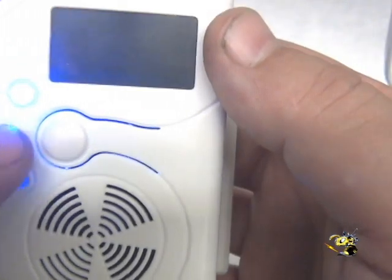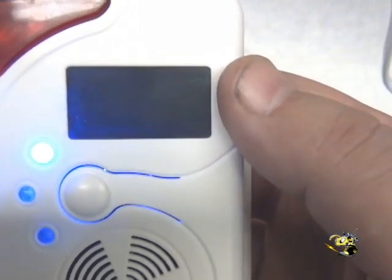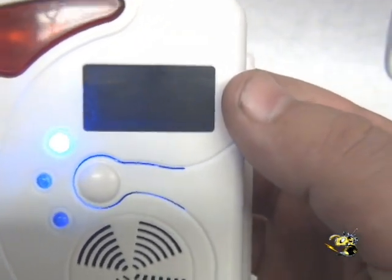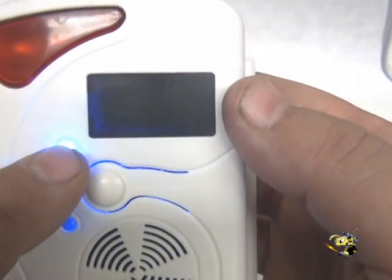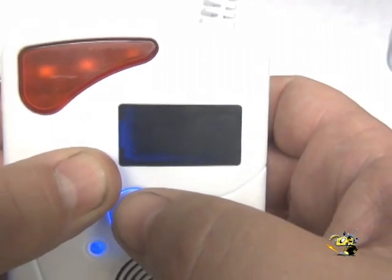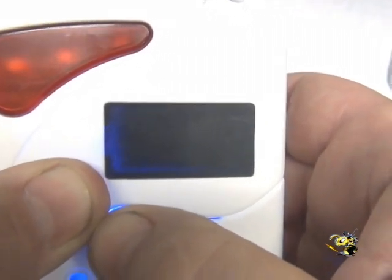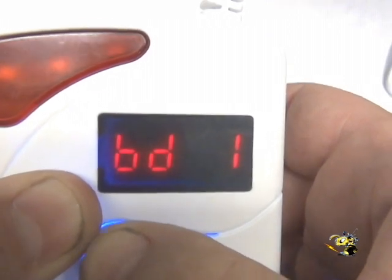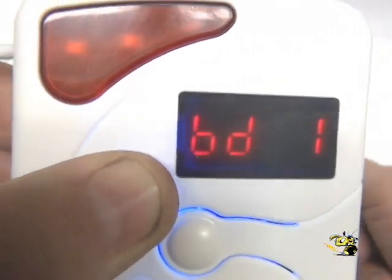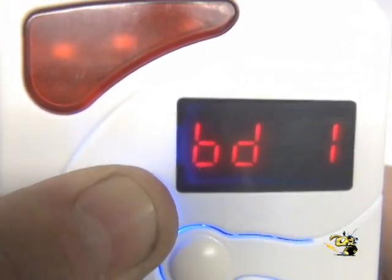This has a fault sensor circuit and a test sensor circuit. So to make sure maybe once a year or so that your detector is still in working order, you can test the palladium element and double check it. Hold down on this button to do a fault light test and it's just going to go through its paces — it's going to heat up the sensor and make sure nothing's going to trip it accidentally.